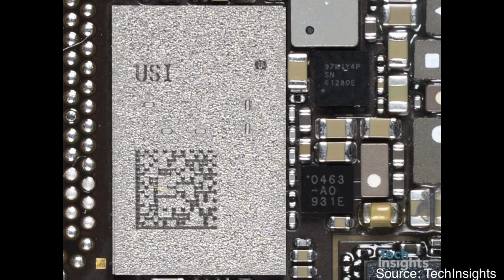It does not need to make a rubber stamp and does not need to change the rubber stamp for new information, because laser marking can change marking information just by modifying the drawing in the marking machine. In most cases, marking is made on the surface of molding compound.